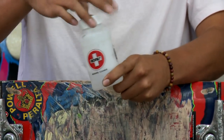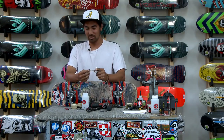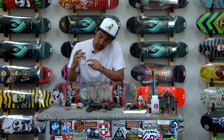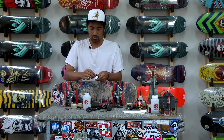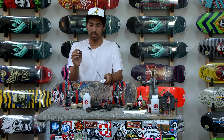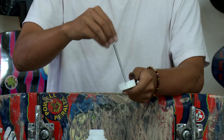We're going to open up and put the bearings on this guy. The bearing cleaning unit comes with seven individual spacers which will space out the bearings. You should know that we fill up the bottle with acetone to right below the 'bearing cleaner' label. Put the bearing in before the spacer and make sure the open side is facing the lid of the bottle, so that way when you're shaking, the acetone will fall through like a waterfall cleaning everything out.